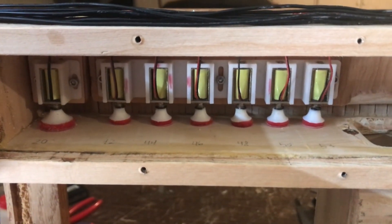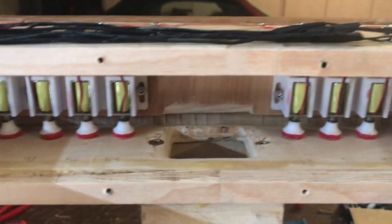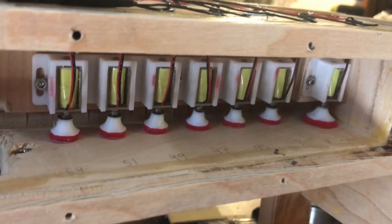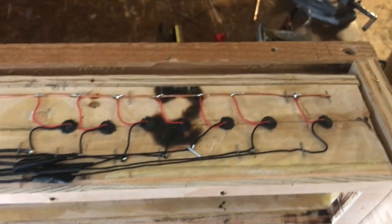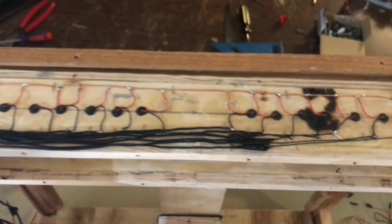And now here's everything working together. I got the solenoids all hooked up and playing a random sequence of notes, and I added some flyback diodes to each solenoid's wiring to get rid of kickback voltage when the solenoids close, which was causing some issues.